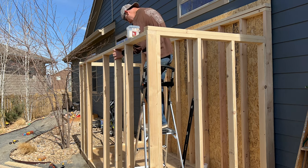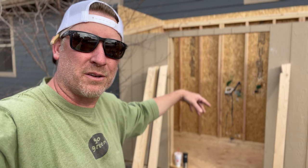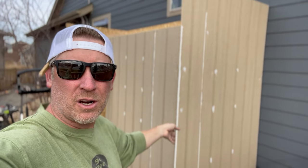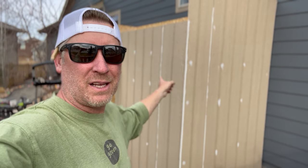The walls are on — I got the front one cut, getting the rafters prepared. I'm getting ready to trim and notch all these out so they set up there on the top plates, and then we'll get the main roof put on. Something good to do at this stage is to go ahead and put some caulking on your exposed screws and your joints — keep it weather tight, protect it from the elements as best as possible. So I've done any screws or joints that are not going to be behind some kind of trim. I still did it on the corner — just in case some water gets behind that trim, I still want that corner to be secure.